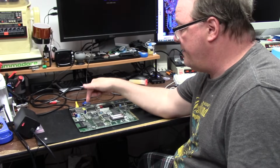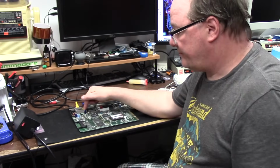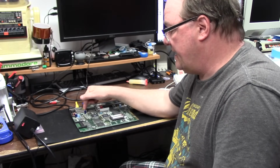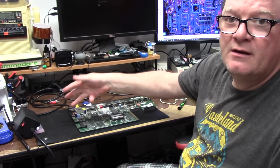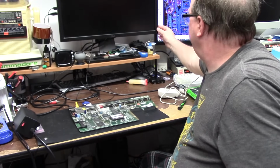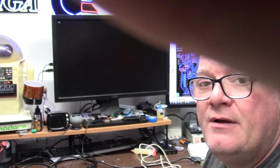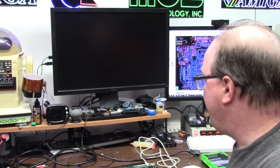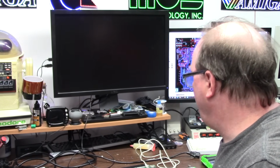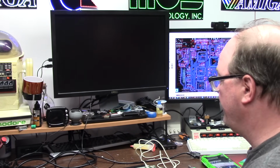We're going to test both the composite video, that should be in color because we have that CXA 1145, which takes the chroma and luma and shoots it out the modulation side. This is on RGB or VGA converted, in my case with the Amiga kit adapter. It's going to take a few seconds because, again, I lost my DF0 terminator. I don't know where it's at. I've lost 4 of them. They're on somebody's board.